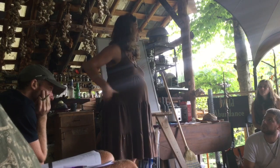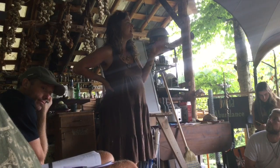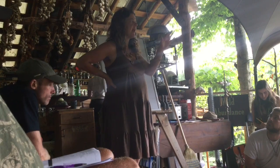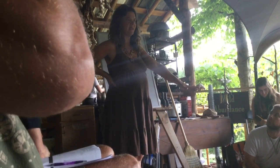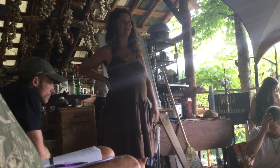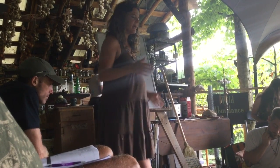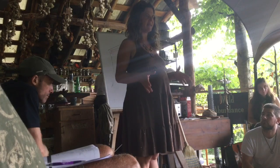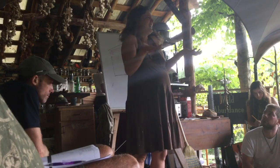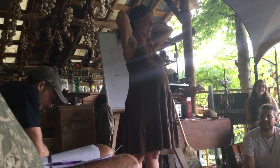Depends on the tile. If it's dark, so that's one really important thing that I want to put forth about mass, is that you want your mass to be dark in color. Because what happens if you touch a white rock that's been out all day in the sun? It reflects the heat. It's still going to be probably a little warmer than some other leaf or something, but you want to have dark colored mass. I've seen people do tile floors in white tile, and I'm like, what are you doing? I want to clean that anyway. Yeah, exactly. I think they got a really good deal on it.